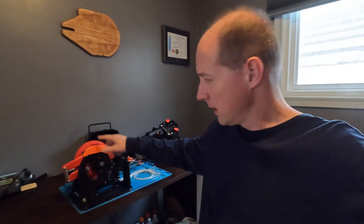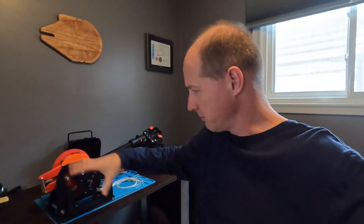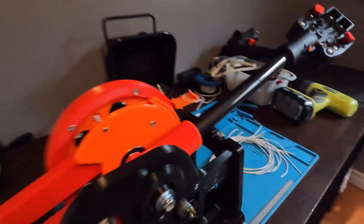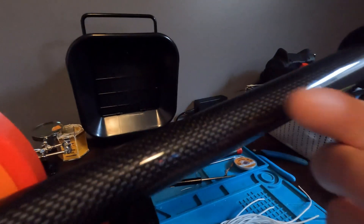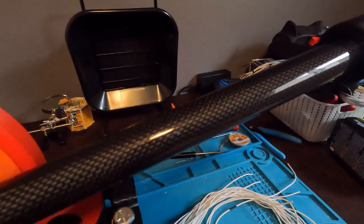That is a 3D printed collective for a helicopter. I got these plans off 737 DIY Sim — I'll put a link in the description. This has been quite the adventure: probably 40 hours of actual physical work and around 150–160 hours of print time just to print this, because as you can see everything is 3D printed — half-inch thick pieces and all kinds of little parts down below. The main shaft is actually carbon fiber, bought off Amazon listed for hobby drones — two one-meter chunks for about $12.